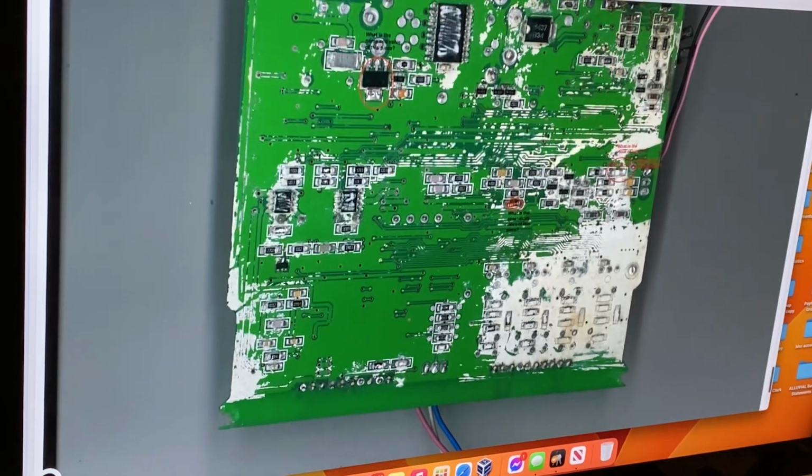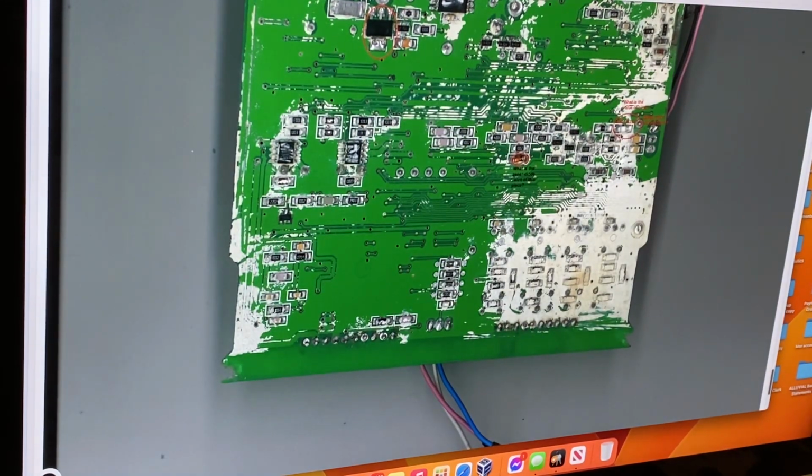Okay, this part here, what is it? It looks like it's a capacitor, or it could be a chip resistor put in upside down. I would say it's a capacitor. I'm not sure. I've never had to look at this component before in any repairs I've done on these. I don't know what that is. Looks like a capacitor, and if it's a little ceramic one like that, it won't be much. It might be something just under 100 picofarads or so. I'd have to get one off a detector and stick it on the capacitance meter to see what it was.